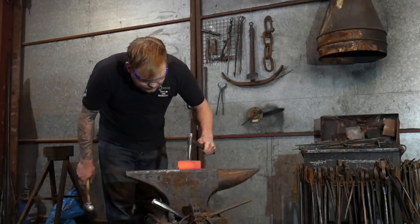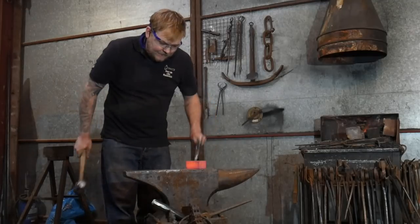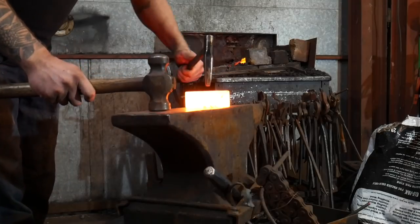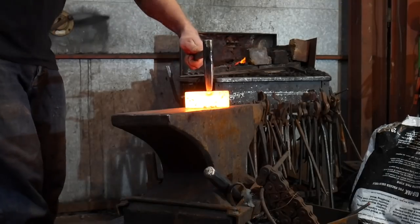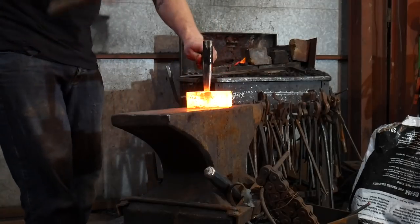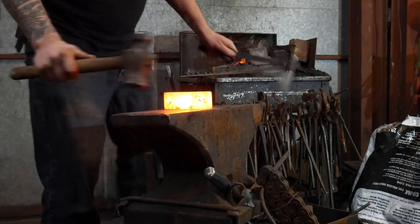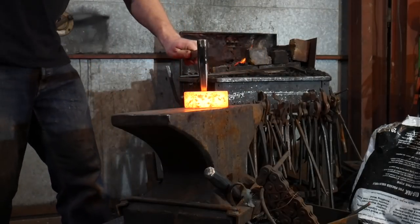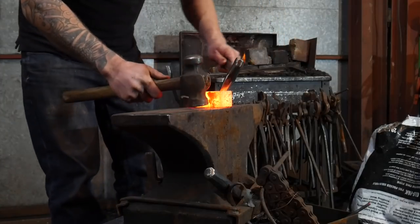That's a little bit off — I'm just going to straighten that up. Take our stock, pop it on the anvil, get this first mark, quench it off, and rotate it. This first initial rotation will take out any errors in the tooling, then I'm going to flip this over and quench it off. It's important to remember to keep the tooling as cool as possible — basically don't let it stay in the work for too long.